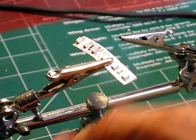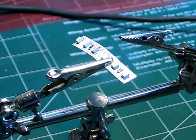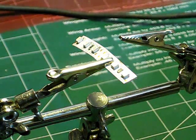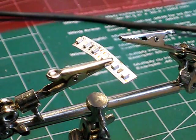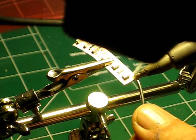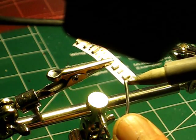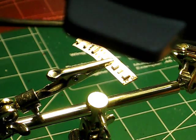On this particular piece of LED tape it hasn't been tinned already — there's no solder on these contacts. Depending on which one you buy, sometimes they come through with solder already applied on the connections, and sometimes not. What I'll do is just go ahead and show you what I'm doing to correct that. I've got it in my helping hands and I bring down my magnifying light, which is extremely useful for this. I'm just going to dab a little bit of solder on each one of these terminals — bumping it on there with the iron itself, tinning the iron and letting the heat transfer it onto the contact, not trying to feed on too much solder, which winds up blobbing up. Now we've got two nice little dots on there.